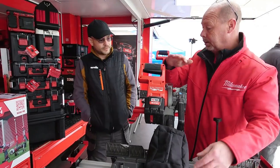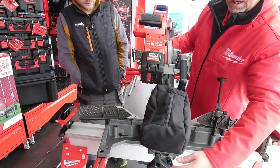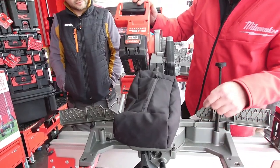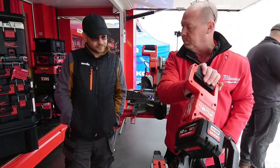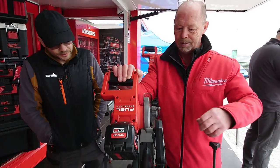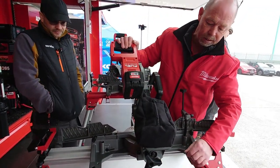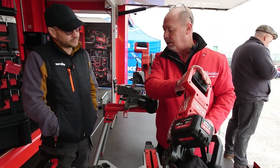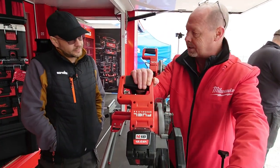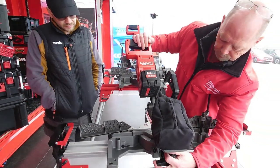Again, if you're moving regularly from left to right, you can lock it out. By pulling that out and then just twisting it, it's extended. So now we can bevel both ways, so much nicer than having to think in your head which way you're going to turn the timber. To release that, just twist that knob again and it slots back into place. Whenever you bevel to the left, when you move back up, it will automatically stop at 0, unless you physically interact with that switch. Okay, so we'll lock that off there.